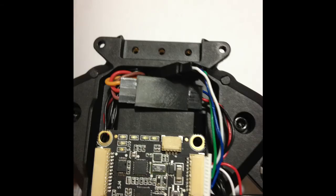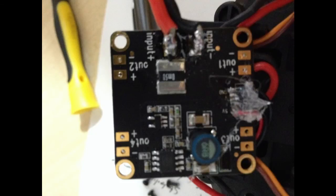When I was putting things back together I had a bit of a disaster. I was pushing the power distribution board back into place and I broke off the connector — real pain. So I had to solder the wires directly, which took me about an hour. I then covered it with hot melt glue to act as a bit of strain relief and mounted the board again, taking extra care this time.